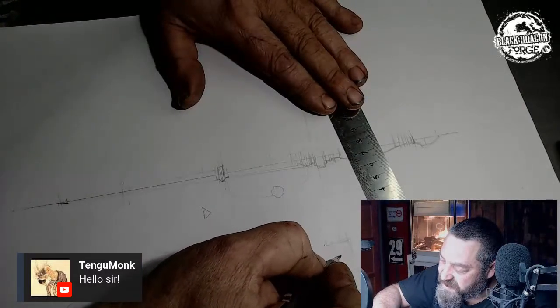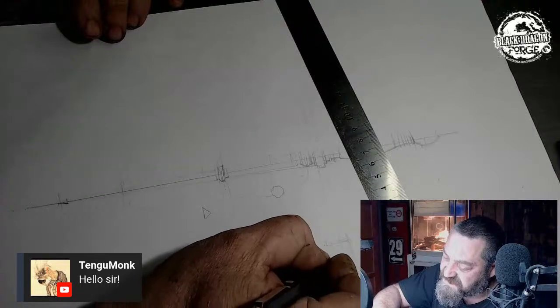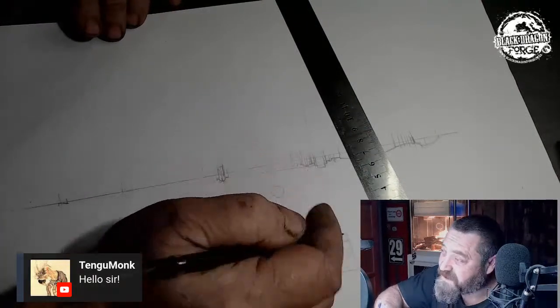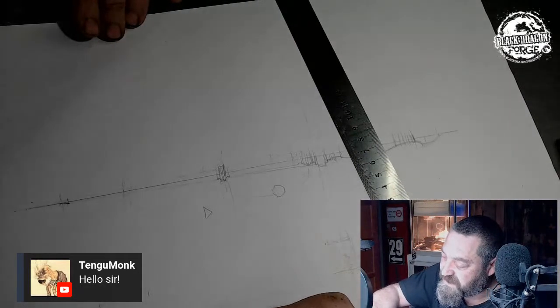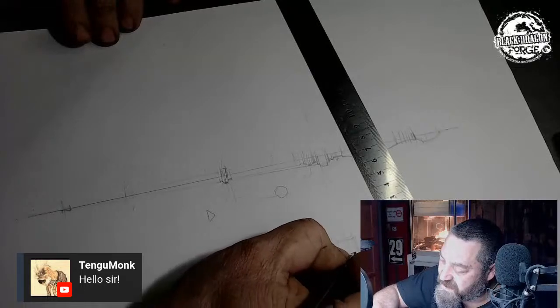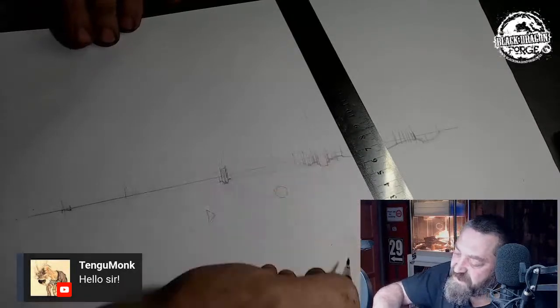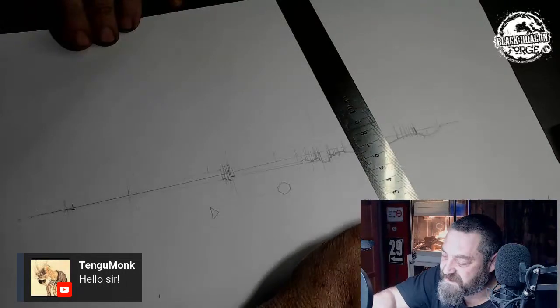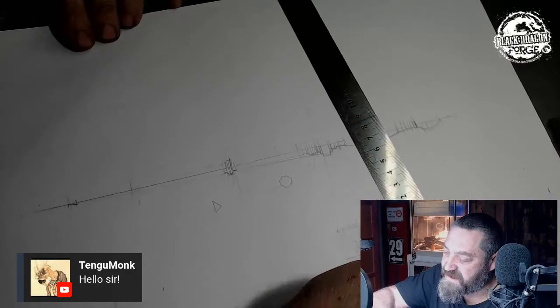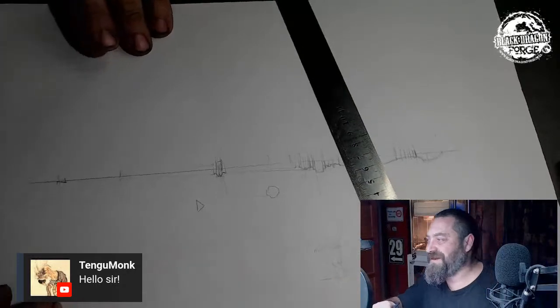And this is where I'd go and get calipers and the whole thing and actually draw a 12 millimeter circle, so a radius of 6, seeing that that little first transition is 6 mil. Yeah. So I'll then do a radius of 6 millimeters, which will give me a diameter of 12. All I want to do is leave 2 mil in there. So a 2 millimeter spacing, so that seen from this edge, I have got that. I've got that. Got that. And then I've got that 2 millimeter spacing there. Does that make sense? Well, I hope so. It's not like you can ask questions.